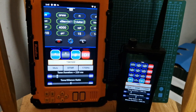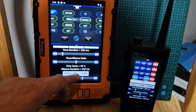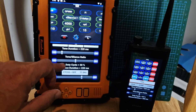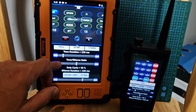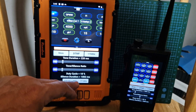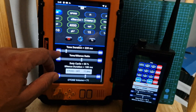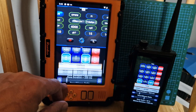So we want star, three, four, one, five, two, two — tick, okay. If we scroll up a bit we can set a CTCSS, which we've done. You've got the tone duration — so that's how long it makes the do-do-do — and you've got the gap between tones as well. You can set CTCSS and CTCSS volume.